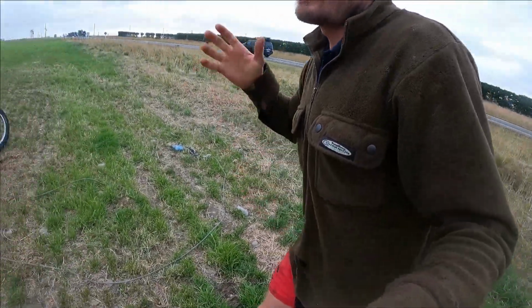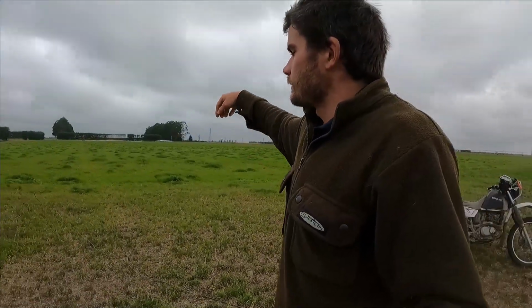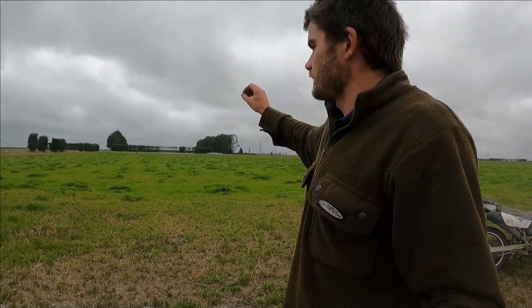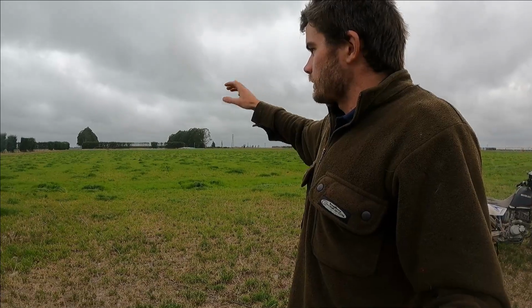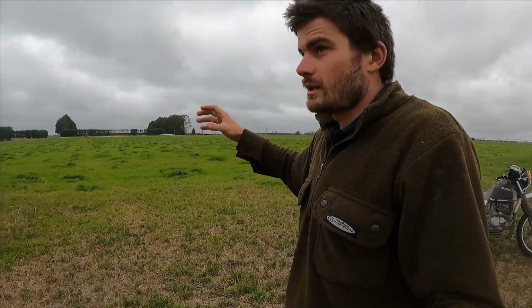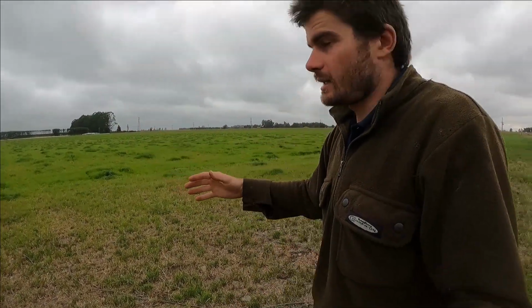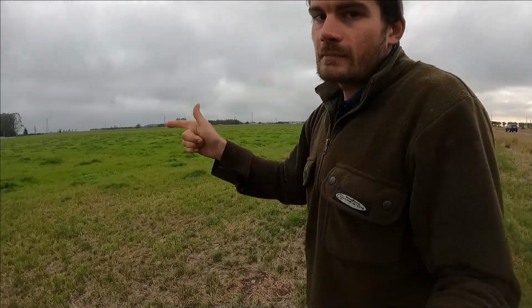So what we're going to go do now is turn the hydrant on. The water pressure will go to the Roto Rainer, it will go out the booms, and then that pressure will expand that hose under the turntable, and it'll click itself into gear automatically. So right, let's go do that.